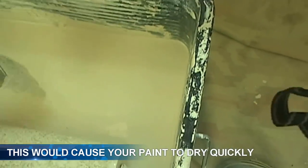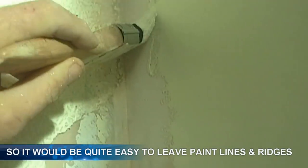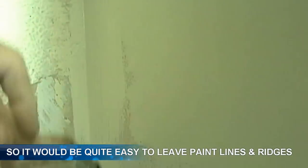Dip the brush in, same, you can see it's quite wet, slap it on the side to get the excess off. And then round the perimeter of the ceiling or the wall, continue to brush in. Now I'm not going to be fussy by cutting in with a brush, because I'm going to paint the whole room, so I'm just showing you the brushwork. The same rule applies when you're using the brush to cut in. Just make sure you gently take out any brush marks.